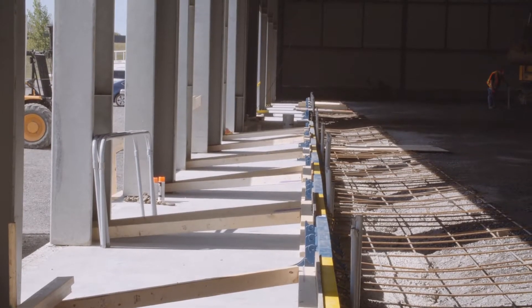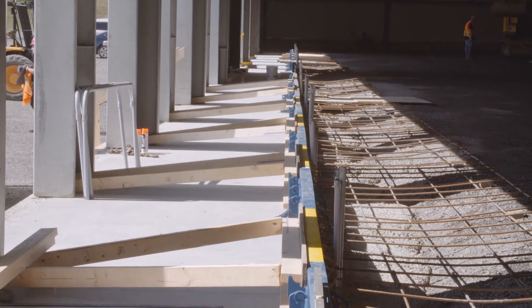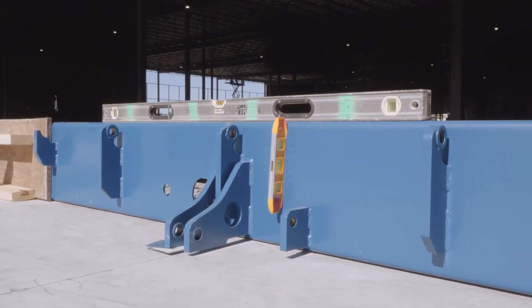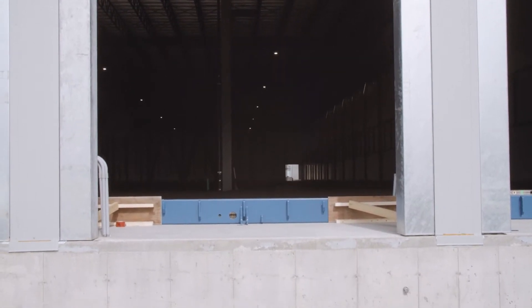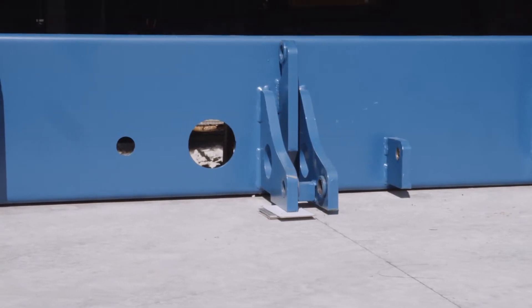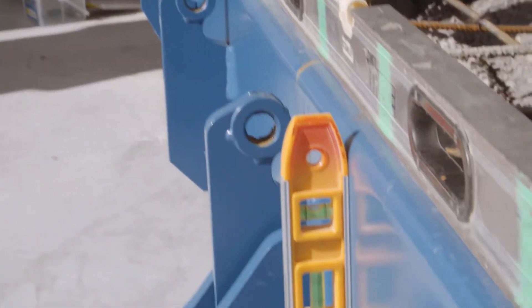What we've done here is aligned an entire 13 positions all in one even line. The pit floor has a half-inch slope so that if any moisture comes down, they can actually wash it out of the building. So for the unit to be perpendicular, you need to shim the front edge and level it out to get that angle correct.